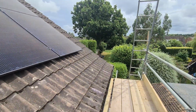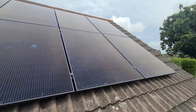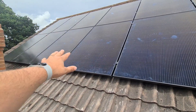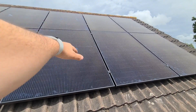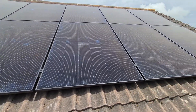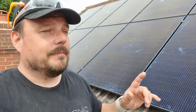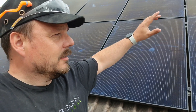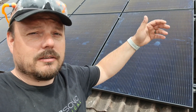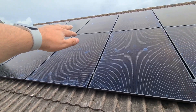The guys are on the other side — you can probably hear them grinding. It's starting to peek through some sunshine so we can see a bit of the generation downstairs. This is wired as a string of eight panels together here, and six matching with the six on the other side on a string — that's just the way the SolarEdge software put the system together. You design it all on the system and once you've done that it positions the strings in the orientation that works best for the direction of your roof. The sun picks up those panels in the morning on the other side of the roof and then swings around to these ones, balancing out the system in the best way.